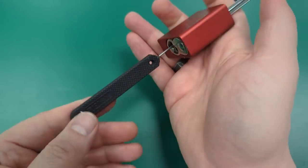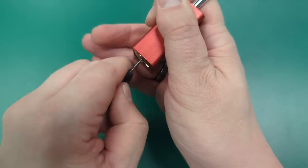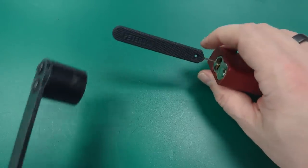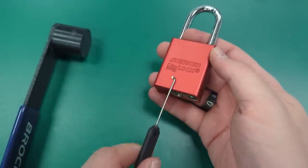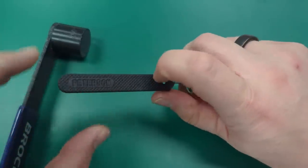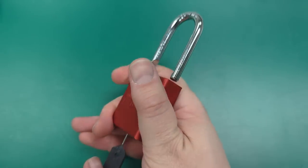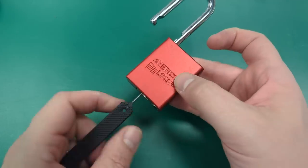That can be a little struggle sometimes. The more you do it, you really learn there's a lot of pressure and hunting around till it drops into place. If it doesn't feel like it's going for you — this one I got, all right, that one's pretty good. But I really had to palm it pretty hard. Something I often do: if you have it in your field kit, I keep a bump hammer around. I'm going to go all the way through the lock, push in and turn clockwise. To get it properly seated, I give it a little bit of counterclockwise bias — just a little bit of counterclockwise pressure — because that'll help line up the slot, and then some encouragement. When you first do it, it's more of a turn than you think. It's a lot of turning force to overcome that spring, but that pops it open.